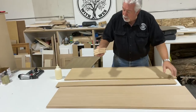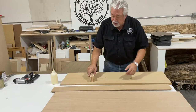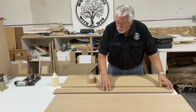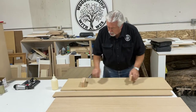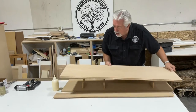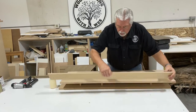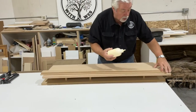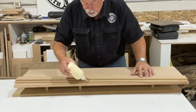These little spacer blocks will hold our top and our bottom apart so that we have the thickness that we're after. This is a 4-inch thick floating shelf, but let's go ahead and get started putting it together. We're going to use our little spacer blocks here to help us in our assembly. Set this up. We're going to glue and nail with 18 gauge inch and a half nails for our assembly,